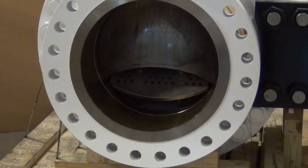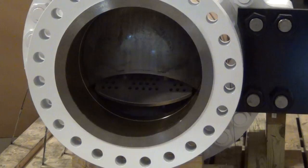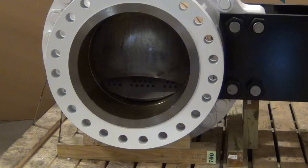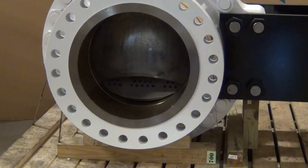This particular model is a booster pump, so we have a smaller motor and pump for small set point changes, and then for larger set point changes, the larger motor and pump activate. Once you approach that point, the larger motor and pump turn off, and the smaller motor and pump finish the positioning.